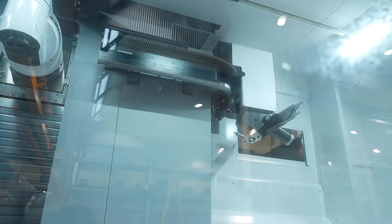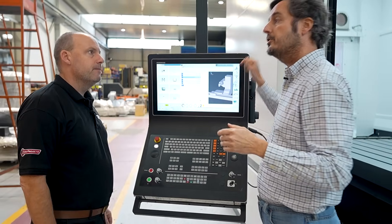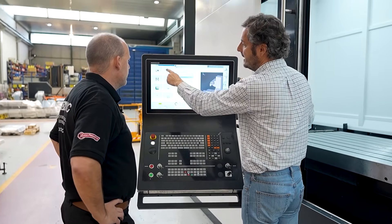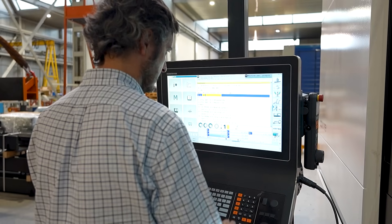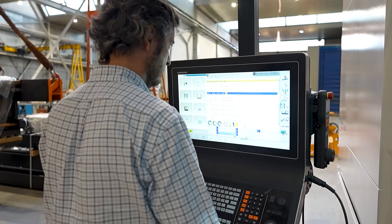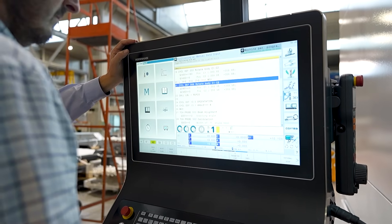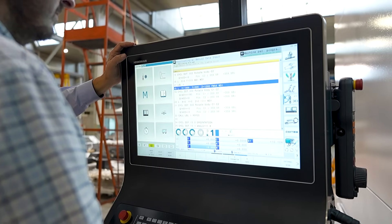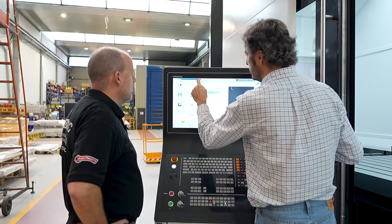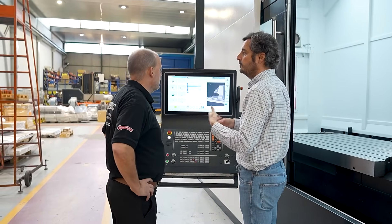This is modernized as well. I look at this control panel — graphically, the 24-inch touch screen from Heidenhain is one of the biggest. Here we have integrated our Correa HMI, so we have our own functionalities to improve the efficiency of the control. We also do a lot more monitoring of how the machine is performing. We can provide a lot of information to the operator — for example, the power and torque diagram of the spindle on a real-time basis. These features help the operator to monitor the machine and use typical functions very quickly.